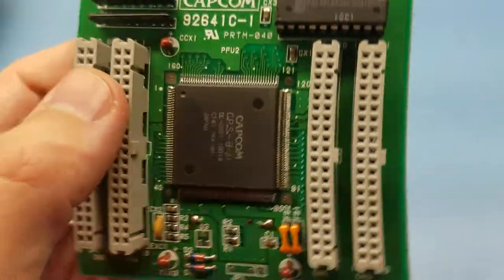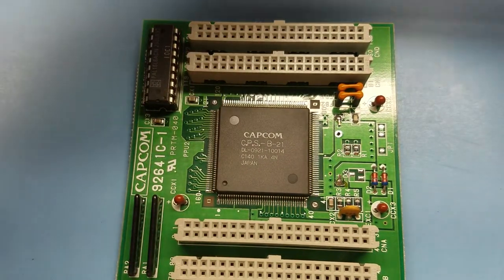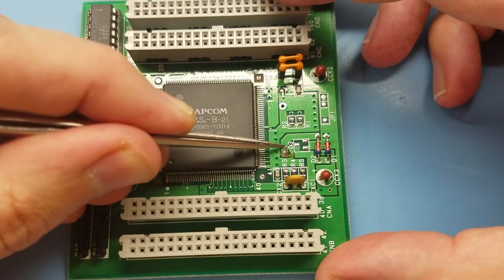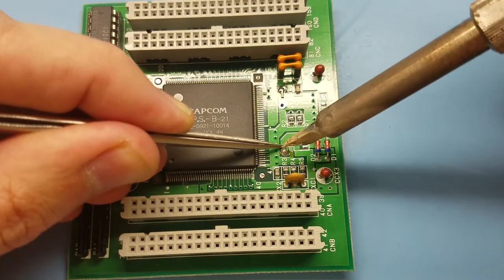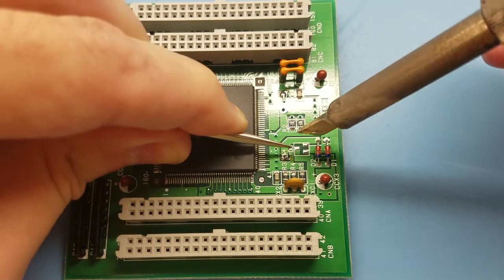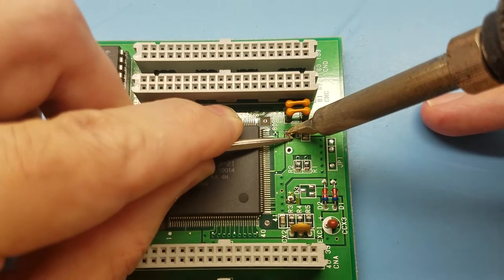As you can see, those leads are kind of folded over. So my thought is to get my tweezers under those as I'm applying heat — getting under there with some tweezers. Then I'll come in with my iron and apply some heat. These solder joints already look nice and clean, so I'm not too worried about applying new solder to them. I'm bending this up carefully to get it as vertical as possible. That one's pretty much done. I'm going to do the same on this one.